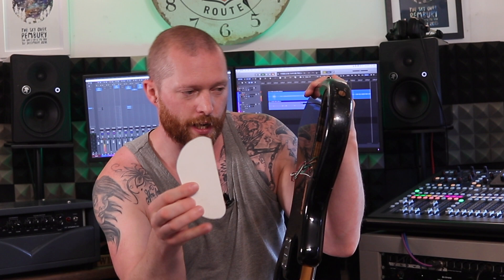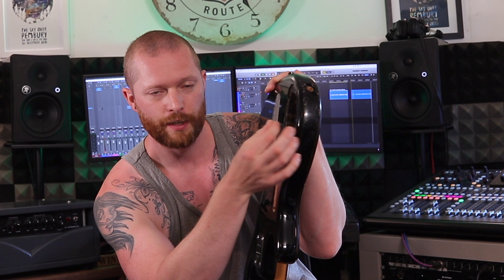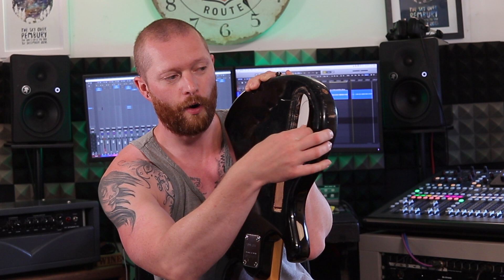What I did was I got some cardboard — very clever — and pushed it into the cavity shape, then drew around that and kept cutting it out until I had a little cardboard outline of the cavity shape. Then I put this on a piece of timber, drew around that, cut it, and sanded it to the shape of the cavity, and this insert just slotted straight in.